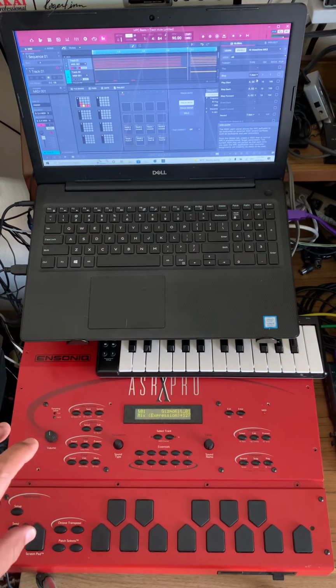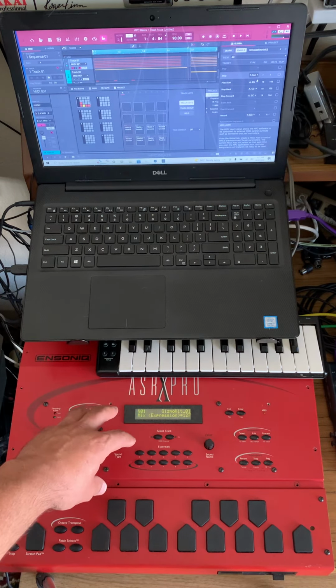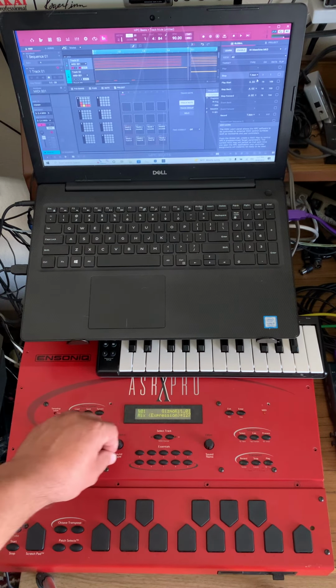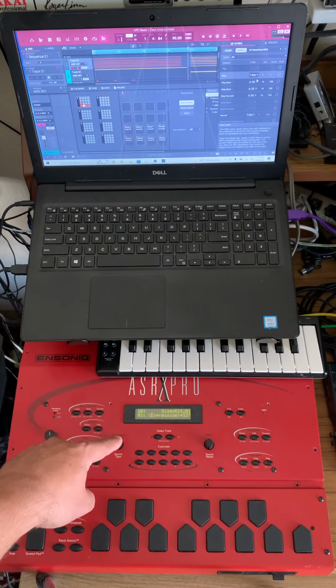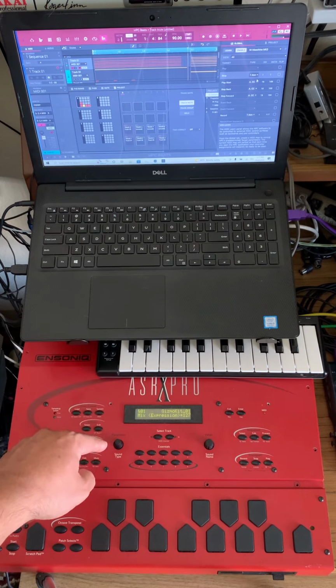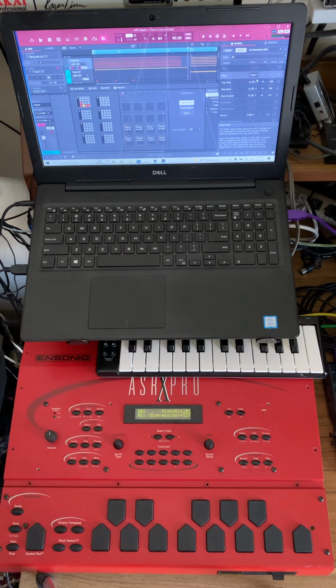In other words, I'll be scrolling through, and this is what caused the problem that I mentioned earlier when I tried to repair it. You'll be scrolling through, and all of a sudden your rotary knob will appear to be freezing up. Well, it's not freezing up. The rotary knob itself is working fine. I know, because I tested it in and out of the circuit about 5 different times. It was working every time. It's actually the operating system that's freezing up.